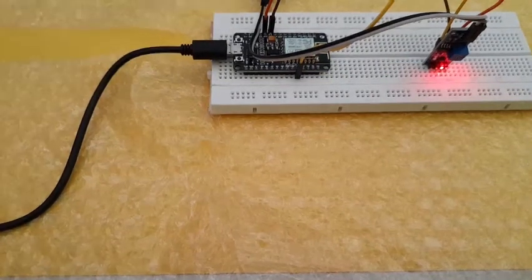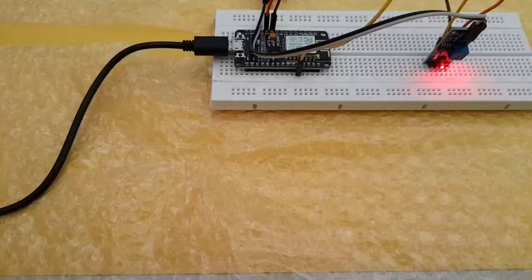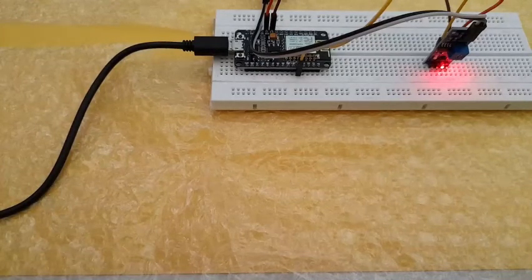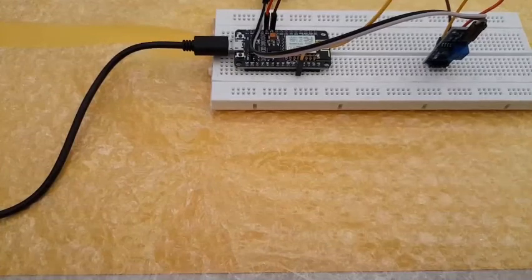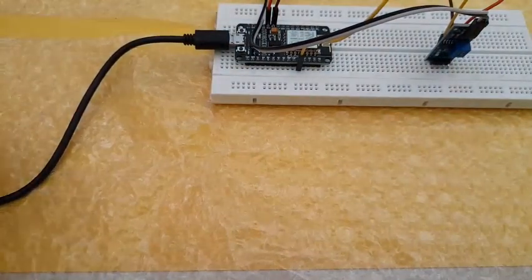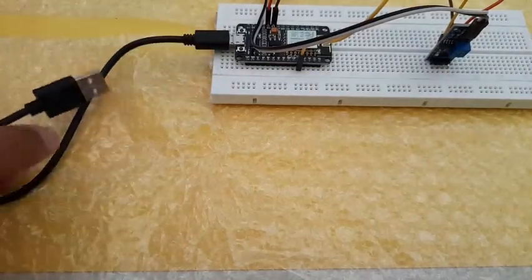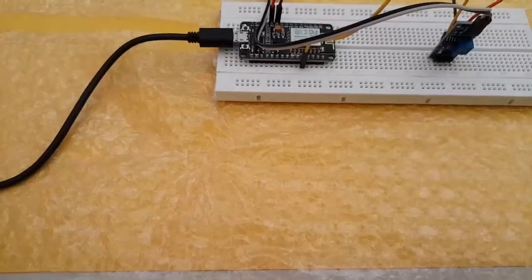Now all we have to do is upload the program code to this board. You'll need a Windows 10 computer with the Arduino IDE installed — install it if you haven't. The code will be in the description below. Keep in mind you have to have the USB connected — take the USB end and connect it to the computer, as WiFi upload is not ready yet for this board. Once WiFi is ready we can use it to send notifications, but for now we do it wired. I'll include a link on how to test the board as well.